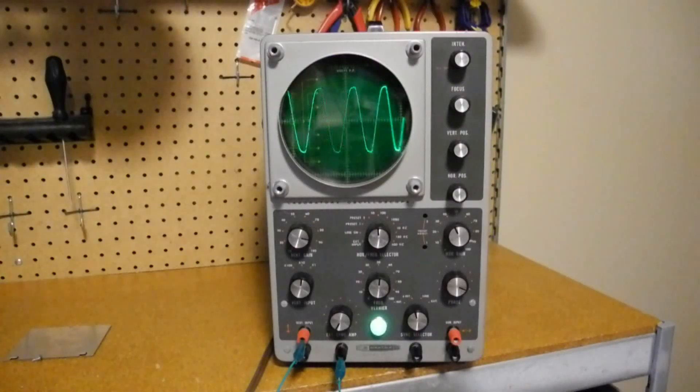In summary, the IO-12 was a higher-end model of scope offered by Heathkit during this era. It provided basic scope functionality, which is quite impressive with a design that only uses a few vacuum tubes. It supports XY mode and a Z-axis input, and has a calibrated vertical axis. The bandwidth was just adequate for radio and TV work, and it has presets for two sweep frequencies typically set to television vertical and horizontal sweep frequencies. Its main limitations were the limited accuracy in the vertical channel, no calibration in horizontal, sync but not triggered sweep, and a limited bandwidth spec'd at 5 MHz but only accurate up to about 2.5 MHz. Incidentally, for users who wanted a dual-channel scope, Heathkit offered an electronic switch that would add this capability to a single-channel scope — see my YouTube video on the Heathkit S3 for details.